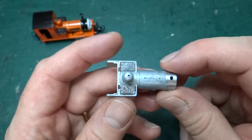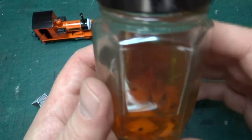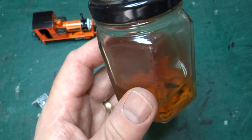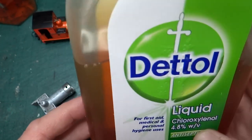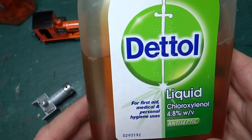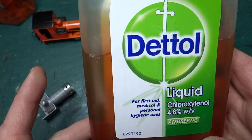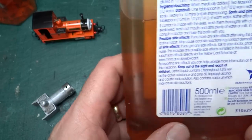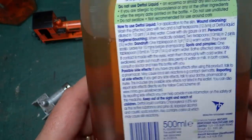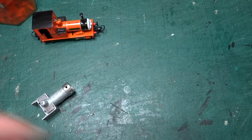As you can tell, it's had the paint stripped off. This was a case of dunking it in my favourite solution, which is Dettol, of all things. For those in countries who don't have Dettol, it's a kind of brown liquid used for cleaning floors and things — you often smell it in hospitals. It also talks about first aid wound cleaning, like a very diluted solution to wipe down grazes. But if you leave metal covered in paint in it for long enough, the paint flakes off.